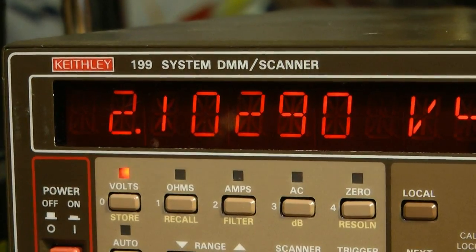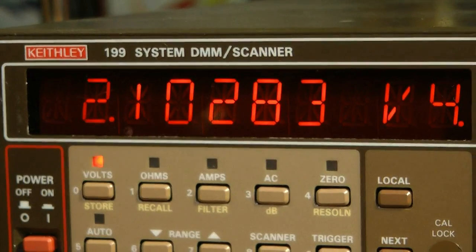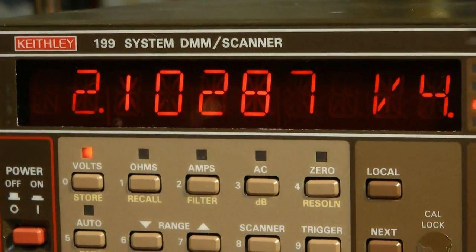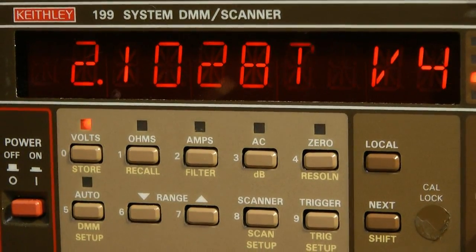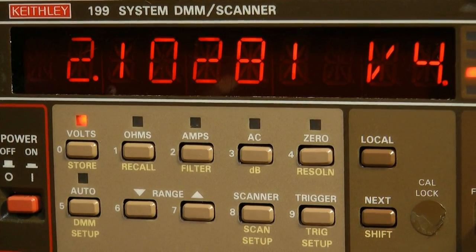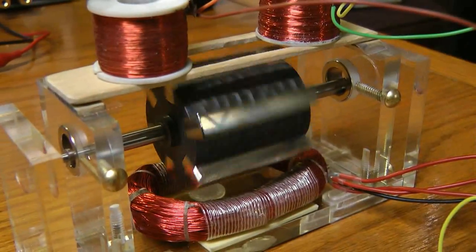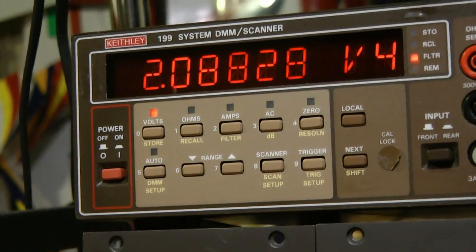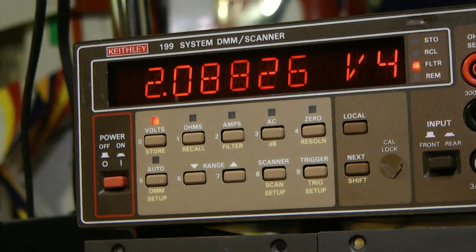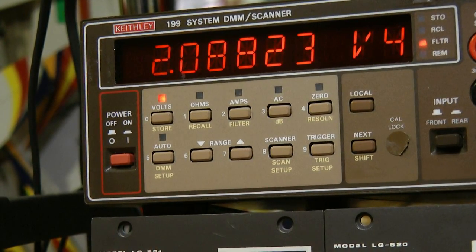I think that's pretty interesting and it's doing pretty well for the first time tuning up this motor with the notch rotor. When I find better substitutes for the transistors and work with the coils a little more, maybe something better will come of it. I'm trying to see what I can do about getting the current down and see if I can get it running lower than my conventional rotor on my other motor. You can see the capacitor is dropping now — it's not going up and down because I changed something, and it has to run overnight again before it'll start that cycle.